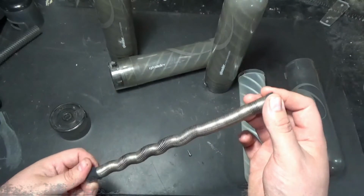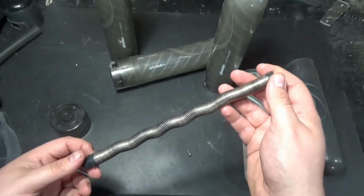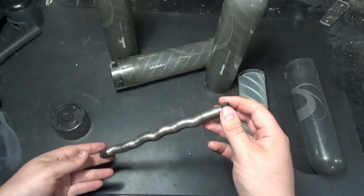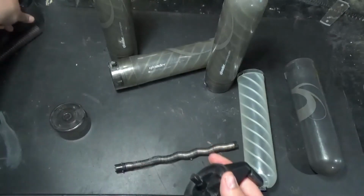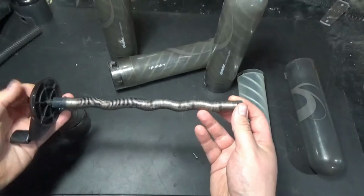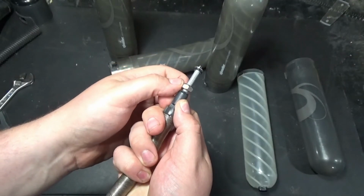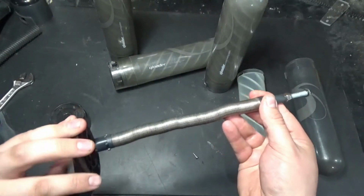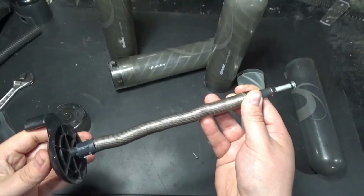When you have to wind these again, over the years I think I used it at a pre-wind of 15 turns, maybe 16, depending on the strength of the spring. I found that the best way was to use the winding handle from your loader, popped out of the shell. I have a lot of these. So you put that in the cap, and then you pull it down, and then you want to rewind the spring. It rotates this way. So to wind it, you want to wind it the other way. So for that, you're winding it clockwise. So it's one full rotation, two, do this 15, 16 times.